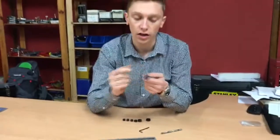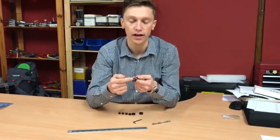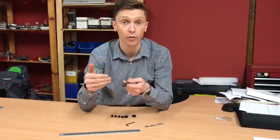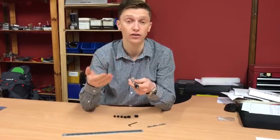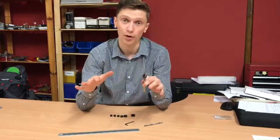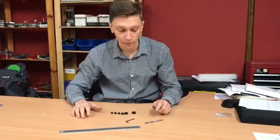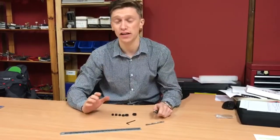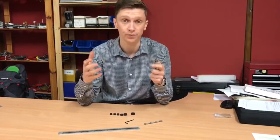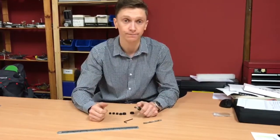When I go back to drill that lock, it'll go through the drill plate, through the case, and not hit the levers. The best thing is you can always adjust it back and go a bit more, so it's really safe. If you hit the levers and they start concaving in, it becomes a nightmare. But for what you pay for them, they last a long time and the ease and stress relief they provide is brilliant, especially on mortise locks.